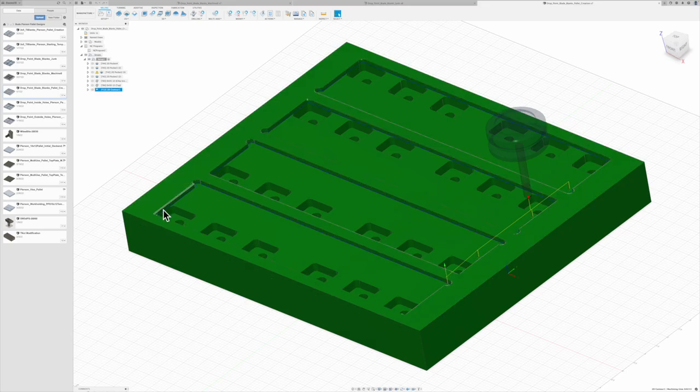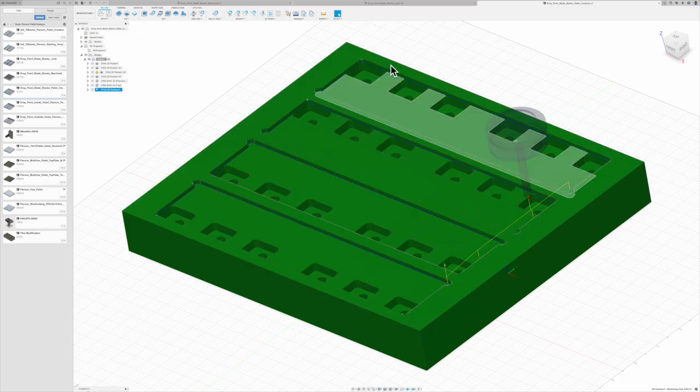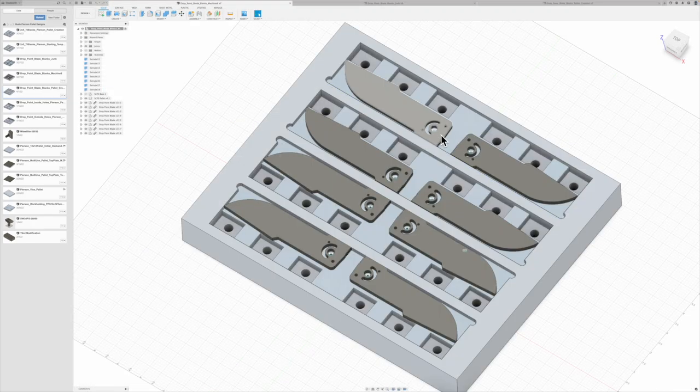And finally, I did remember to put the bevel on here. So instead of using the hand deburring tool on these, we're going to go ahead and cut a little 10 thou bevel on there to clean this up. Should end up with a nicer looking pallet overall. That's what the cam's going to look like. And ideally, we're going to go ahead and show the cam for finishing the blanks on here. So we're going to come back up and take a look at actually setting the cam up on these. And then we're going to put this pallet into operation before we wrap up this video this week. Stay tuned. Let's head down to the Tormach and let's start making some chips.